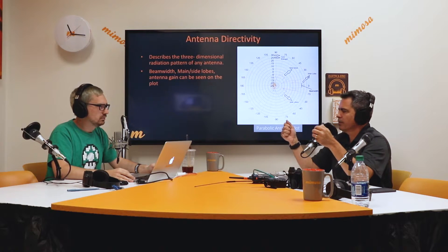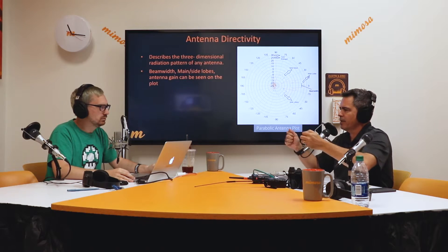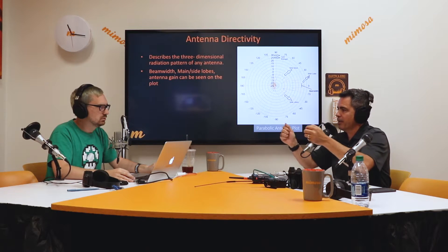From there, keep going to the right — it drops off, maybe it bumps up a little. That might be a side lobe. Try to keep the link going — we want that blue light — then come back to that hotspot. Go okay, that looks good. Now go to the left, drop the RSSI lower, lower, lower. I'm satisfied that the hotspot's the hotspot.